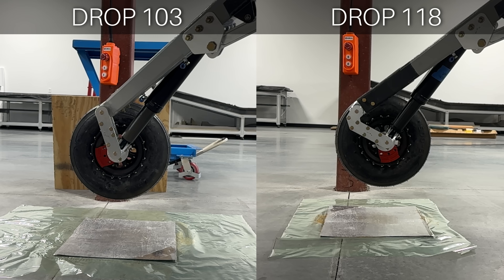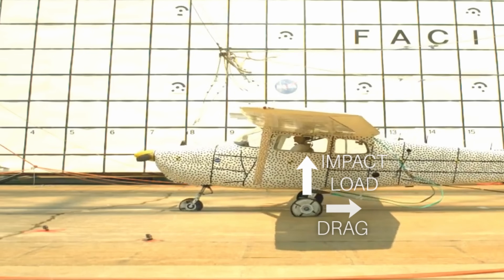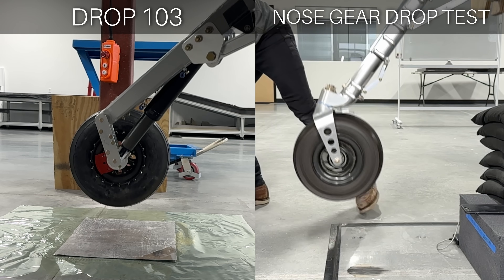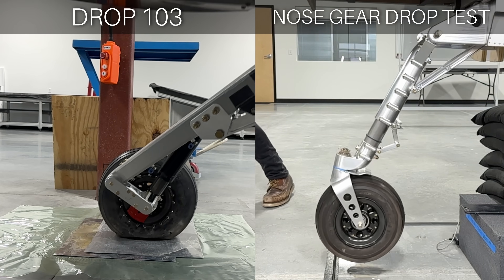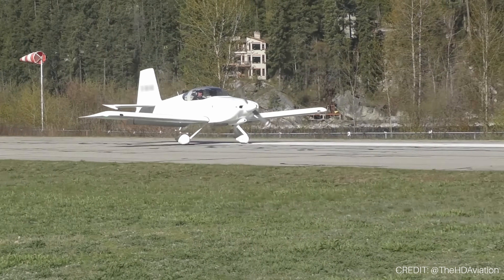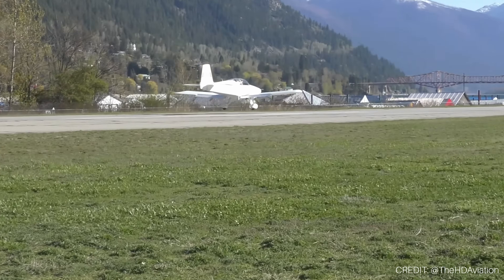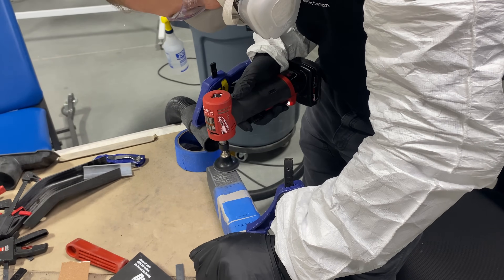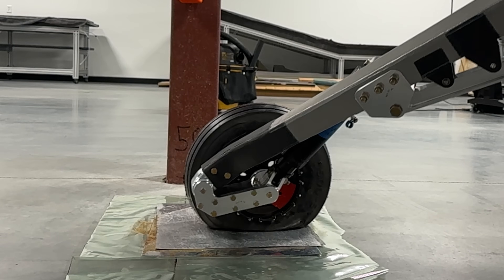Interestingly, drop 118 on the right is run with 225 psi of pressure in the shock — much higher than drop 103 on the left at 150 psi — so the geometry is really what makes the difference here, not dumping pressure out of the shocks. The delay in trailing link pivot action seen on the left is partially related to this test method: the drag load from tire spin-up peaks first, followed by the peak in the impact load, so during a true landing impact the drag load from tire spin-up would actually begin to kick the trailing link back as the tire touches, better allowing the tire and shock to compress together. To ensure the shock and tire are compressing together during a secondary impact, we modified the system geometry by extending the strut slightly — the black carbon end — and added a kink to the trailing link so it wouldn't collide with the strut at higher deflection angles.